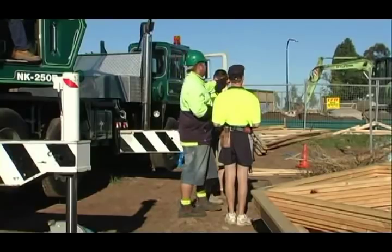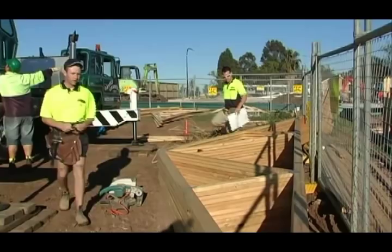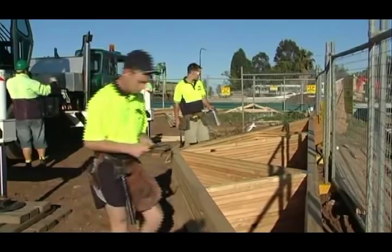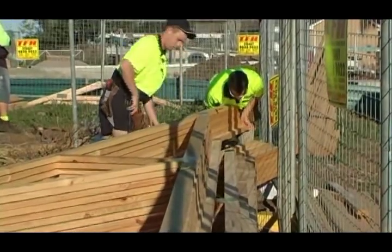An unstable area is a dangerous area. You should discuss the loading and unloading sequence of the trusses at the factory and on site, as this can have a big impact on reducing manual handling risks. Our safety standard, like a lot of current legislation, puts a lot of focus on planning the activity from the get-go.